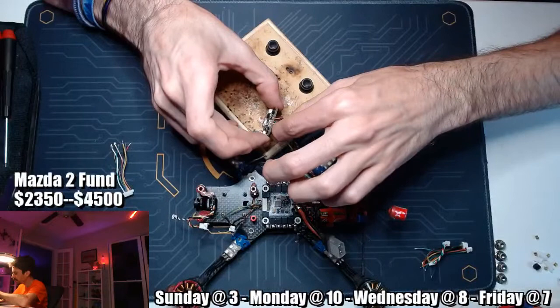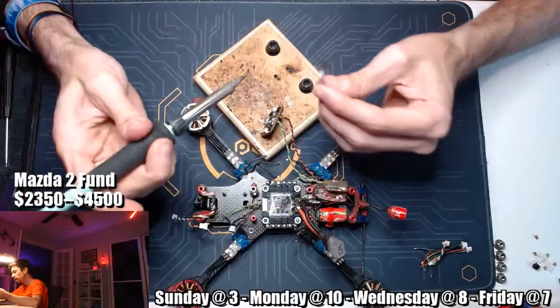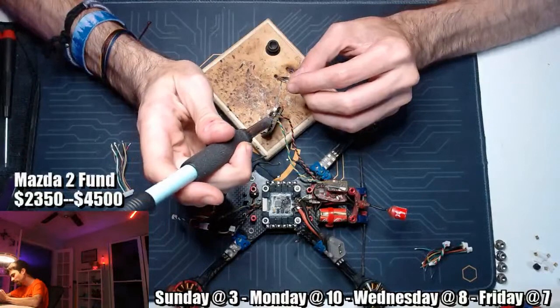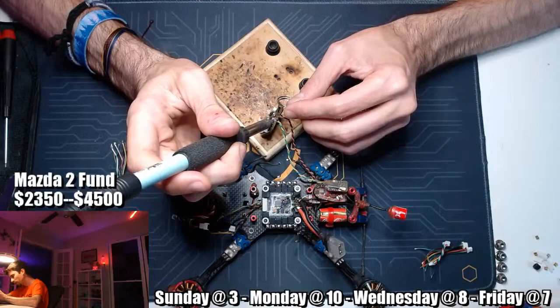And there we go. All right. Same deal. We're going to come in with a tinned soldering iron tip at an angle. And then we're just going to add a little bit of solder. Just be patient so that the whole thing gets hot. That was 1. There's the other.